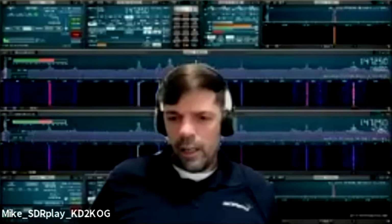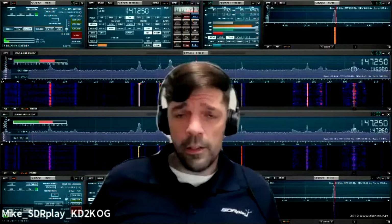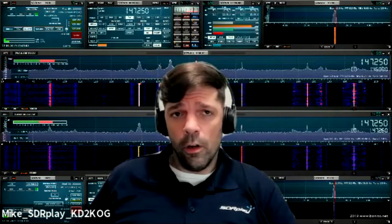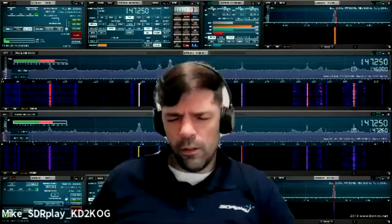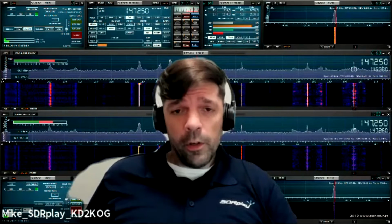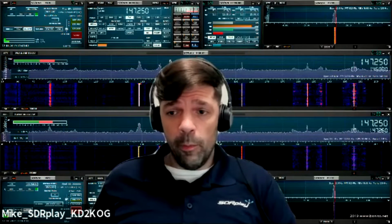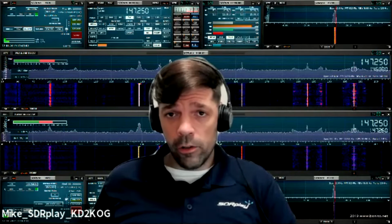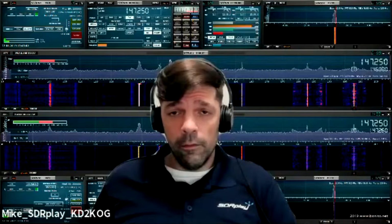Well, I think Mike's probably a better person to answer, but I think it's correct. That's still current, Mike, is that right? You can use the 1708 version B because it will keep everything within a safe level so you don't blow the input of the RSP. But there's other devices. You have a DX Engineering RTR1, RTR2. There's a couple of units coming out of China. There's a few of them. They're generally all the same. You can actually get a 12-volt Dow key off eBay, and as long as you send it the signal to energize the relay, you'll be perfectly safe. But you can surely use the 1708 again. Oh, okie dokie. Fantastic.